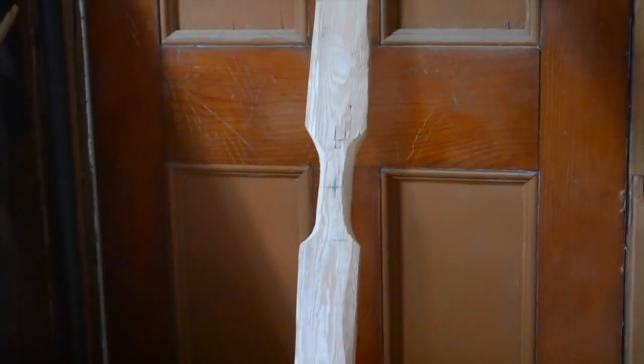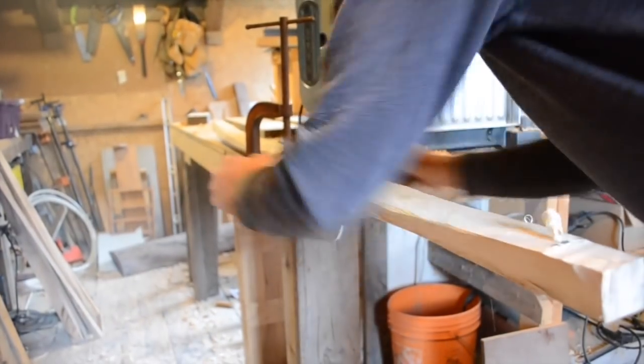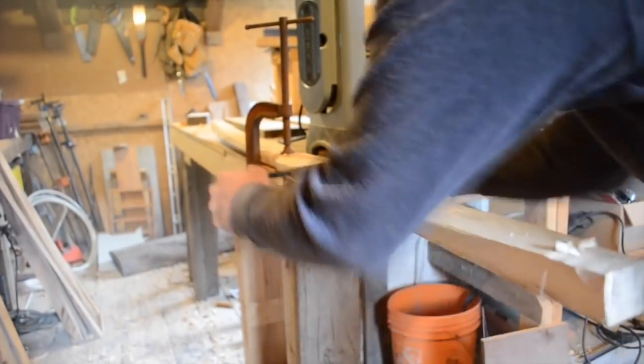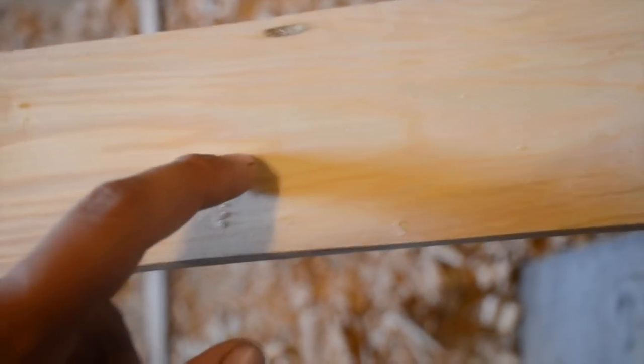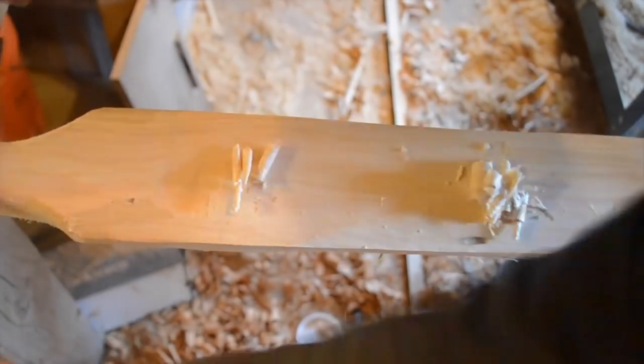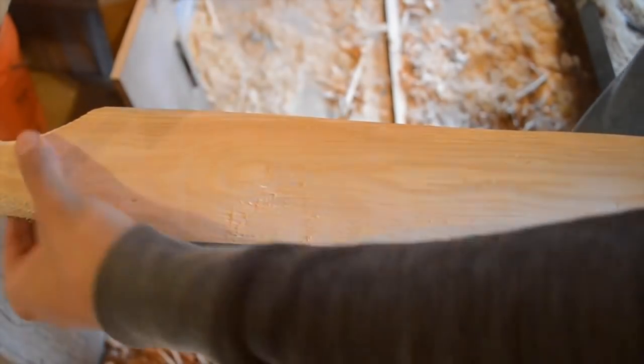Here's the bow staff once all the rough work has been done — it's starting to look like something. On to the next step of thinning things out. I've got the bow clamped to my workbench with the edge just hanging over. The first side you're going to work on is the outside of the bow where the sap wood is. The goal here is to get the front of the bow down to all the same layer of grain. You want to see lots of parallel lines and not many perpendicular lines. The front of the bow has to stretch a lot and every point that the grain runs out is a potential weakness where the bow could tear if drawn too far.